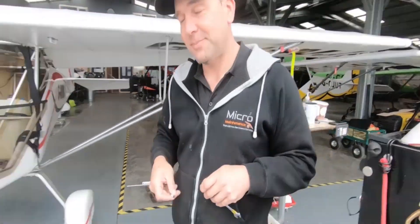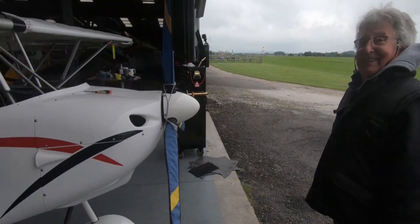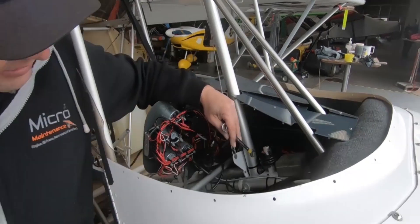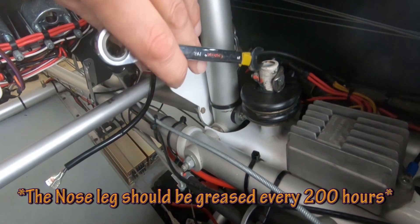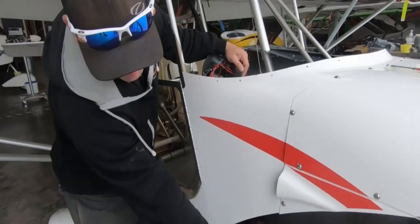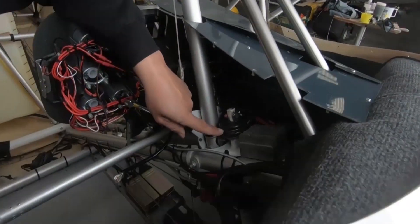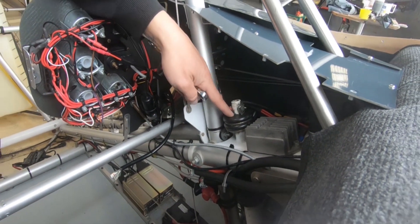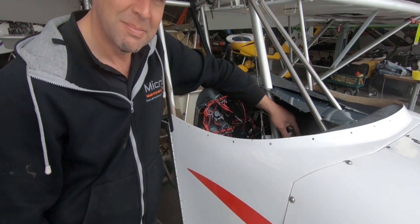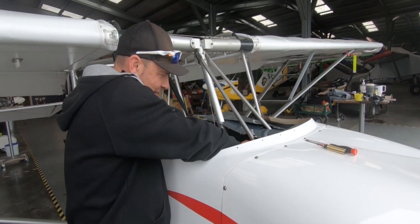Come and have a look at this. I say I found it — I didn't find it. Mr. Alan Jackson, our head of inspectors, did. This is the rubber mount for the nose leg. As part of its service schedule, you take this bolt out, drop it down, and grease the hinge at the bottom. When this was reassembled, someone forgot to put the brass washer on top — so steel on steel. We're going to take it apart and put it back right again. In my defence, I was busy.